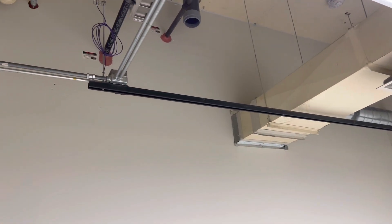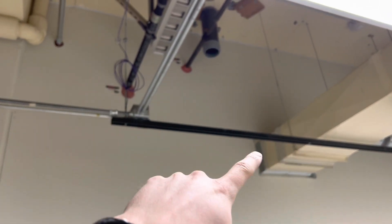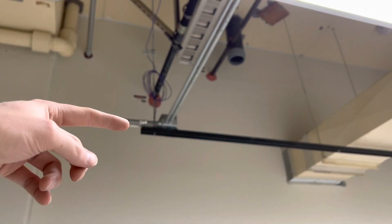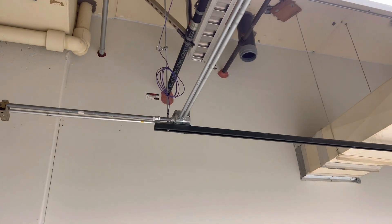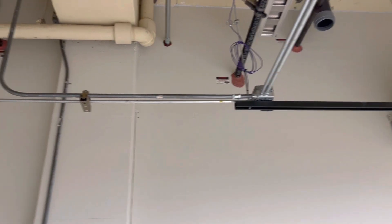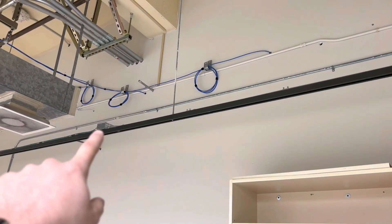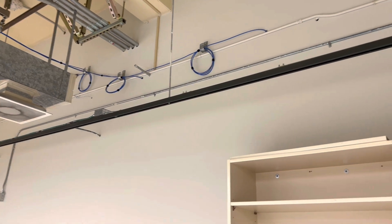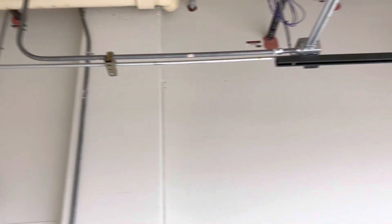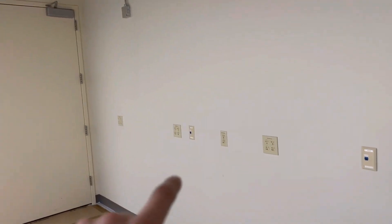They're going to add two lights over on this strut, so we'll just have to chain a couple of MCs from one light to the next. I'm not sure if we'll have enough room in this box - it's getting kind of full - adding a third extension would be kind of ridiculous. So I'm thinking maybe add a box and then pull some more wire down to that box for the other two lights wherever those are going to go.